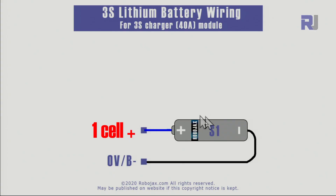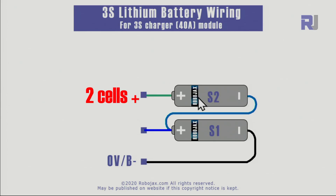For one cell wiring: positive goes to the positive battery terminal, negative to negative — 0 volts at negative, 3.7 volts nominal, and 4.2 volts when fully charged. For a second cell in series: the positive of the first cell goes to the negative of the second cell, and the voltages add up to 7.4 volts nominal. We're going to connect two cells like this.